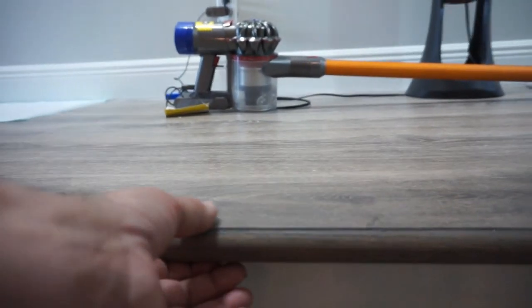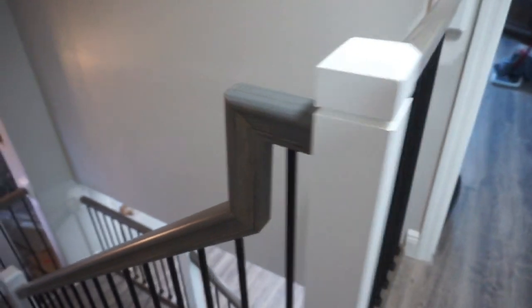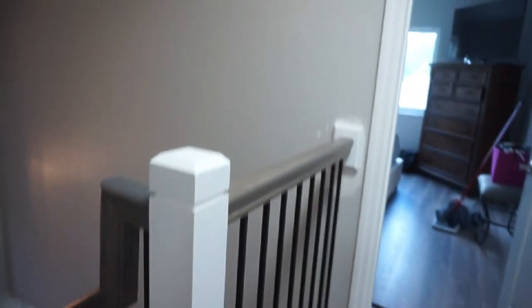As you can see there are no tripping hazards. A lot of people put the stair nose from the laminate at the top but it's tacky and people trip on it. I try to eliminate nosings, stair nosings, and T-moldings most of the time. We come up to the top of the staircase where we have a gooseneck that we created for our drop-down — it brings it from a 42-inch height down to 36 inches — and then we have our hallway railing.